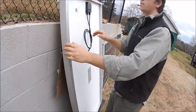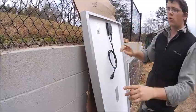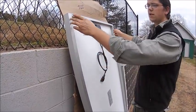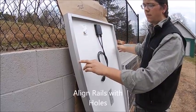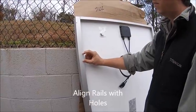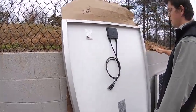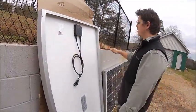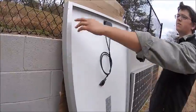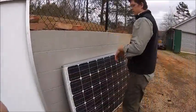This is probably my favorite frame, and this is the way almost all solar panels used to be. Real quick — on a frame, you're going to see mounting holes. You'll always see these holes on the long edge of the frame. The installation manual will usually give you a plus or minus two inches from that hole — that's where they want the rail of the solar racking to be, perpendicular to the long edge of the module.